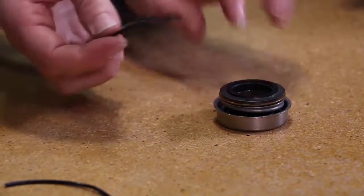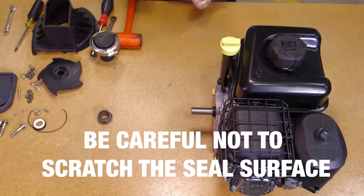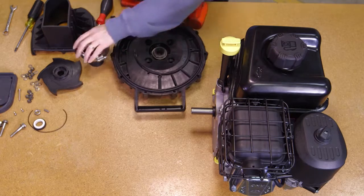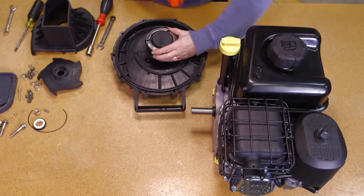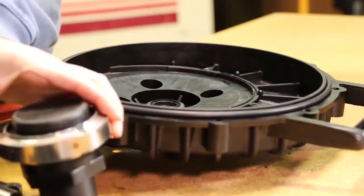Place the replacement seal O-ring behind the lip of the carbon seal half. The carbon seal half should now be installed into the rear bracket. To install, use a tool such as a 1.5-inch pipe nipple or arbor press to give even pressure on the metal flange of the seal housing during installation. Gently hammer the seal into position until it bottoms.